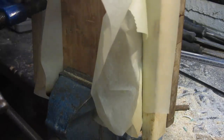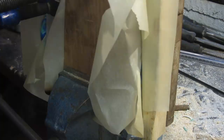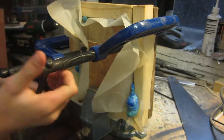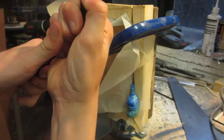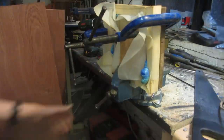Once that's done I can then press it down onto the HDPE and hold it down very tightly until it squishes the HDPE flat. I then quickly use my vice and two G clamps to tighten up the HDPE, making sure that as I tighten it up it stays completely level and I don't tighten up one edge more than the other creating a triangle wedge shape. As you can see I've squeezed so hard that some of the molten HDPE has started to seep out of the edges of the mould. After about 5 minutes of cooling I'll come back and start to tighten up all of the clamps even more, because as the HDPE cools it shrinks and tends to buckle — this will ensure a very smooth surface.